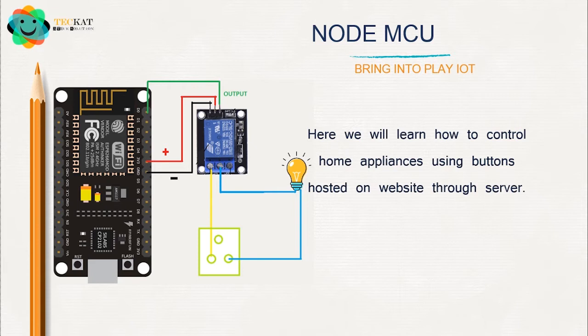The blue module you can see is the relay module, a bulb and a holder to hold that bulb, and a socket for a room AC connection. There are three pins in the relay module: one is the data pin and the other two are VCC and ground. VCC is connected to 3.3 volt and the ground is connected to the ground of the NodeMCU board. As we have used the D0 pin, we have connected the data pin of the relay to the D0 pin.